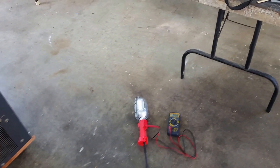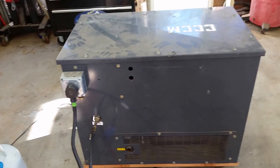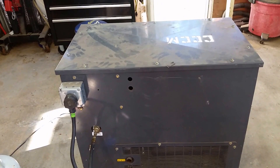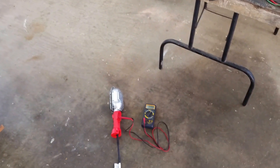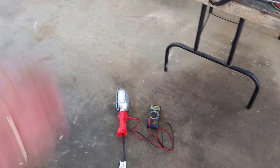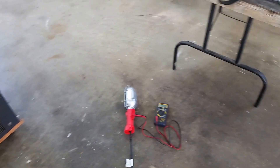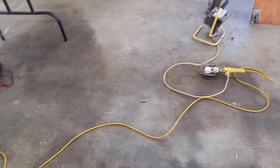it'll filter out a lot of the radio frequency. The problem with a brush type alternator head is the brushes put out a lot of radio frequency, and that's a lot of little spikes for a non-true RMS meter to try to read. I found a way where it'll read true RMS by putting an incandescent bulb on a long extension cord — a friend of mine, I think Roy Amberg, told me about it. Tried to give credit where credit's due.